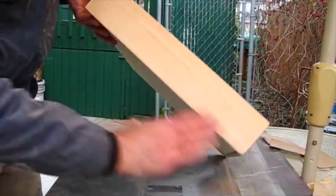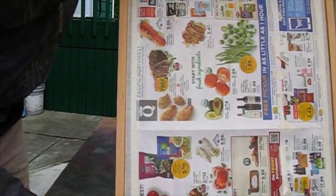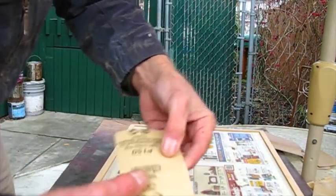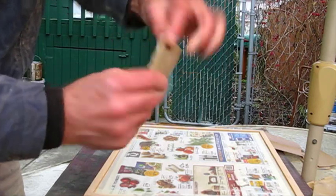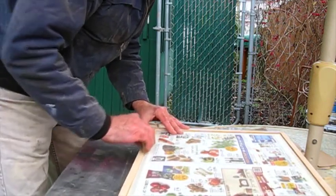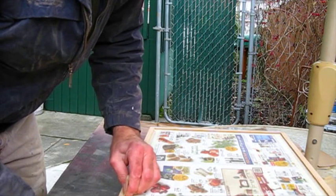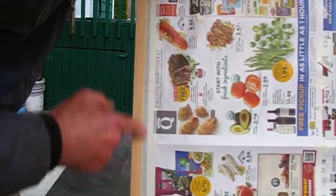All right, so now with the fine sanding, it came out really nice, nice and smooth. The last thing we have to do is sand this edge. Of course, it didn't get sanded, so I have to do that by hand. Just take a piece of sandpaper, fold it, usually I fold it into three, like this. And then I can just go along that edge and clean it up. It actually cleans up pretty quickly, especially in the corner. If you don't do this, in the end it's going to show, look a little different. There, you can see it cleans right up.